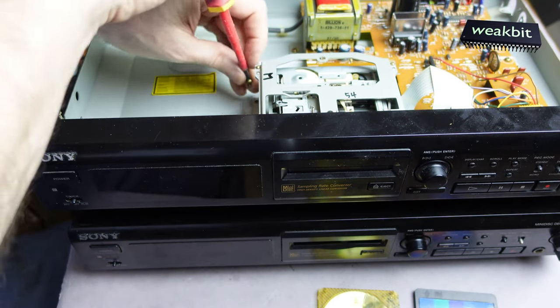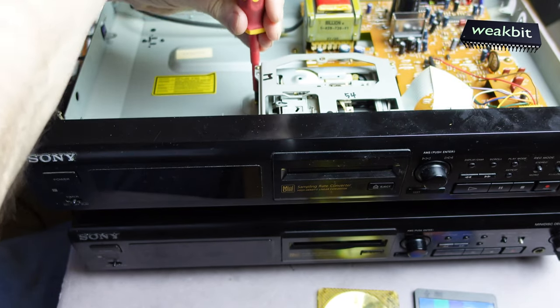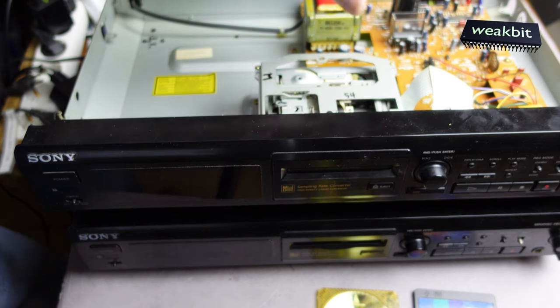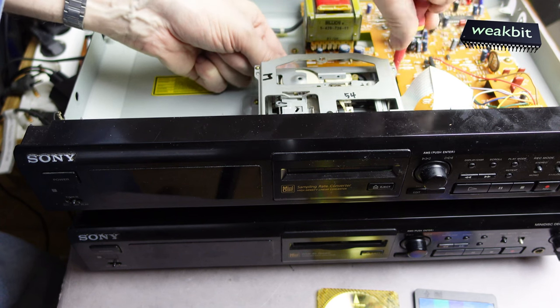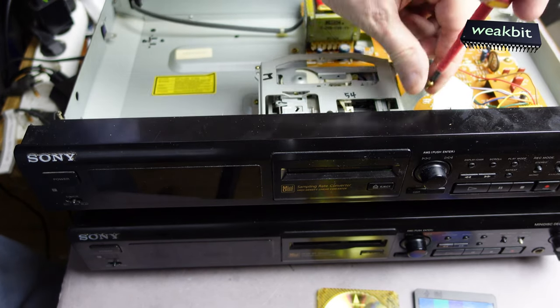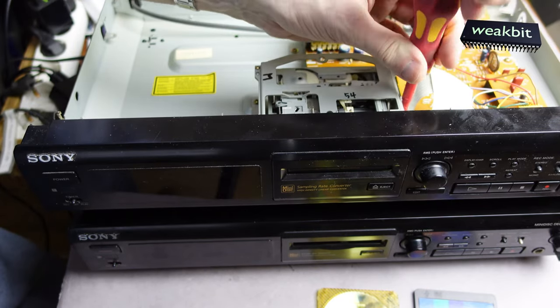And in this machine they have a 22,000 microfarad capacitor. Are they crazy or what? Why don't they build in 4 times 4,700 microfarads? No, they build in a big capacitor that you cannot buy. I mean, this is not a normal standard electrolytic capacitor. Also, Philips Overdrive with their 6,800 microfarads, they don't put two of them in. No, they're making one. I don't know why.